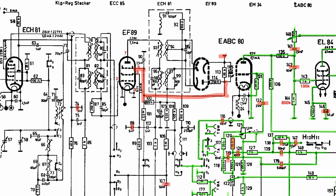Something has changed though — some of the hum has gone. Now, what am I going to do? I'm going to inject 460 kilohertz into this pin over here and check whether anybody has messed with these IF transformer cores. This would have stopped this tube from doing its job. Somebody may have started playing with these adjustments at the top — I know someone's been in here. So I'm going to feed the IF signal 460 kilohertz with a tone on there and see if we can hear it.